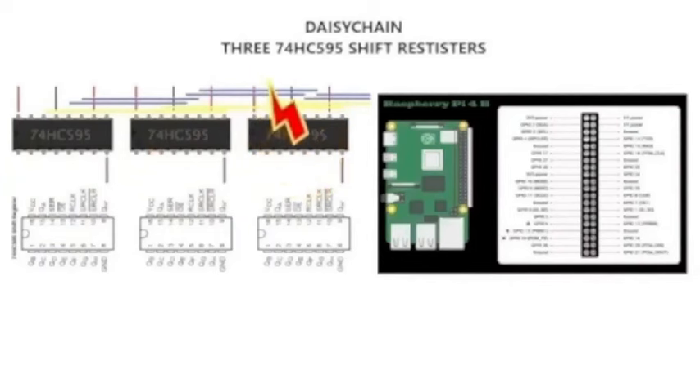Pin 14 needs to talk to this part to connect to the Raspberry Pi. Pin 12 goes into each register's 12, pin 11 goes into each register's 11. You need junctions so that pin 12 and pin 11 ride across all three registers. I should have drawn the two-register diagram the same tidy way, but I kept the drawing because it's actually useful — you might notice what I did and capitalize on it. The student can beat the teacher, and that's what the teacher wants.